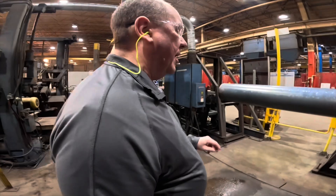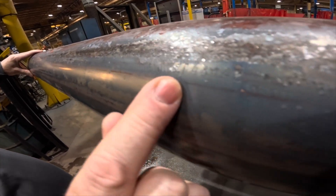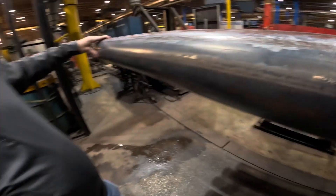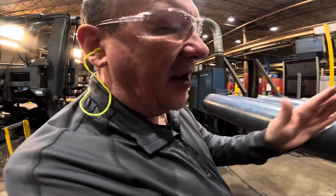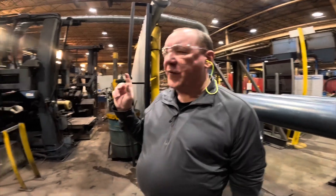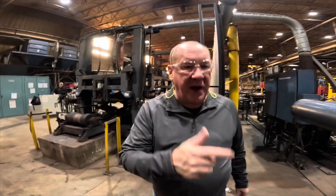What I mean by a heat mark is — you can see these little slash marks. There's a code with 'CF' and some numbers. This is the code and the date of when it went through our facility. So if for some reason we have a problem — say a pipe is failing in the field — I can take the paint off in a circle, find that mark, follow it to that code, then call our guys at the facility and say 'this is the heat treat code — are we seeing more problems with this batch?'